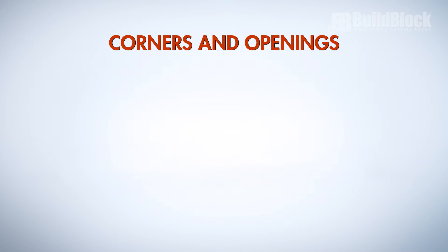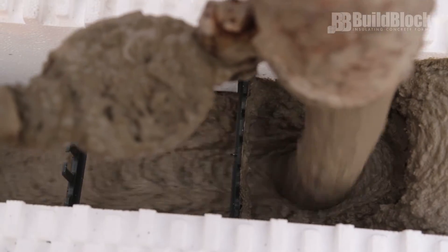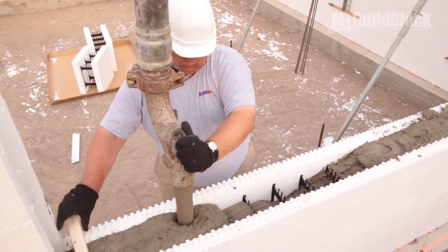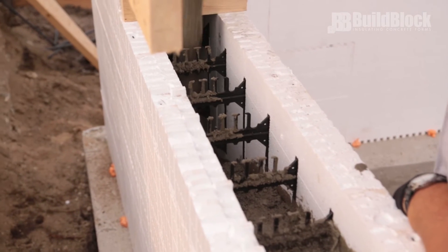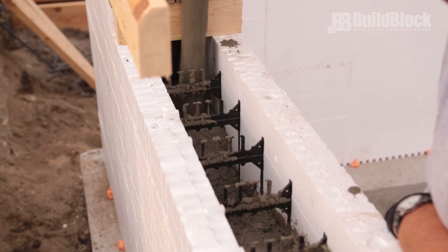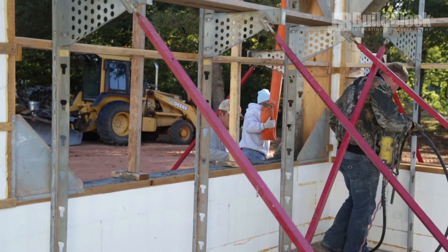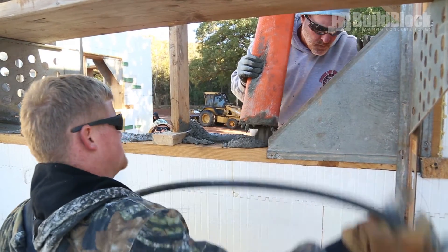Corners and openings. Take special care when pouring concrete around corners and openings. Flow concrete towards the corners as opposed to pouring directly into the corner. Stay at least three feet away from corners until concrete is close to the top and you're ready to top it off. When pouring concrete around door or window openings, pour a small amount of concrete on either side of the opening first. Building up this small mass prevents too much concrete from building up too quickly on one side and pushing the door or window out of square or plumb. If necessary, you can fill from the concrete inspection ports below before pouring from the top of the wall.